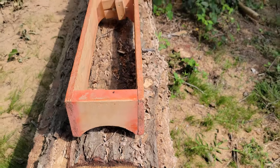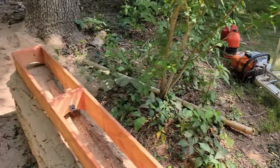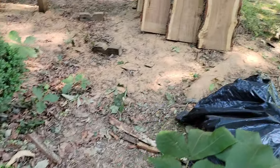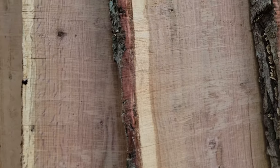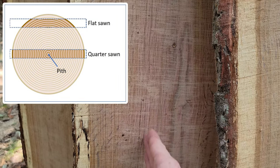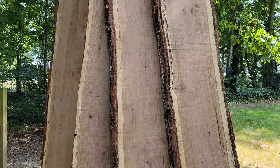After I make that first cut, I put the guide back on to keep the log from drying too much. Then I use the Granberg mill and chainsaw to make continual passes. After several passes, I ended up with four beautiful two-inch-thick slabs of white oak — the two in the middle are especially nice. I expect I might get some cracks on whichever slab was closest to the pith, the center of the tree, because this is quarter-sawn with growth rings running one way, while the others have rings running the other way and will warp differently.